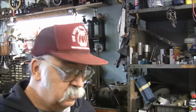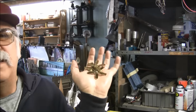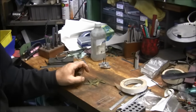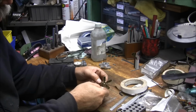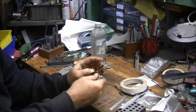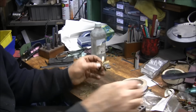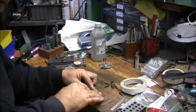Okay, I took them off of the machine and then got the tape taken off of them, the backing tape, and you know, they're not deburred yet. And I need to sit at my bench here and do some deburring on them. This one here, I see that my end mill, yes, not quite. So it's only a couple thou from going through. In the center here, it looks like it just kind of mushed the material down. But I think they'll clean up pretty good.